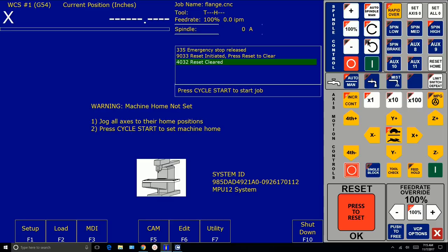Let's go over to the virtual control panel. These are spindle control buttons we'll use in a later video. Here's a reset home button. Limit switch defeat. What we're most concerned with right now is the incremental and continuous jog button — this is the jog mode. When it's in incremental it moves in multiples of what you press: multiples of 1, 10, or 100. Because we just want to test axis movement, we want continuous mode — when we press the X buttons it will move continuously as long as we hold the button down. Let's see if we have movement.